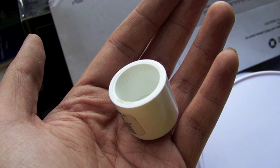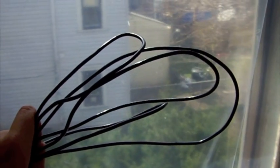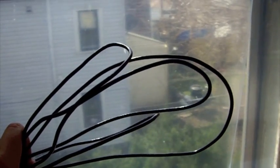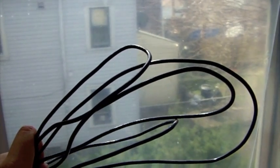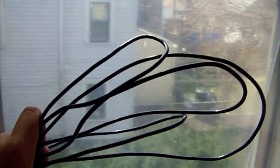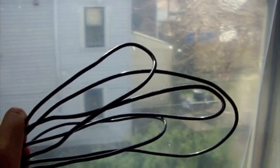The first thing you'll need is a half inch PVC pipe at least 104 inches long, and two end caps — I used the non-threaded type. You'll need copper wire; this is 12 gauge solid copper wire. Solid copper wire is harder to work with — harder to measure out and prone to kinks — but it's easier to solder with at a thick gauge like this. Stranded thick gauge wire is easier to work with, cut, and measure, but it's harder to solder to. If you're using thinner wire that really shouldn't be a problem, but this is the gauge I would recommend.